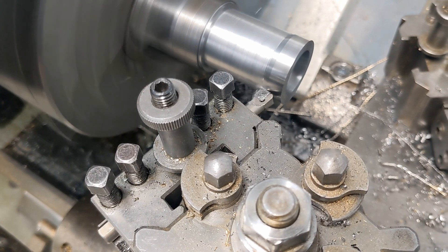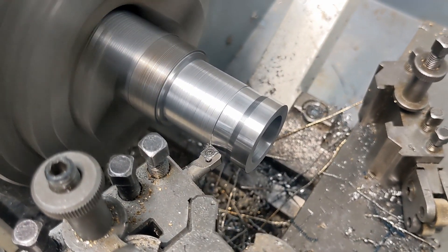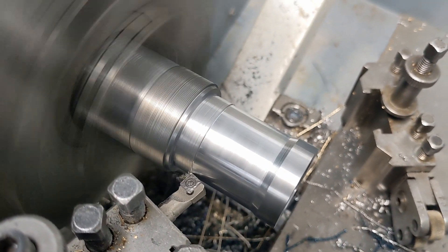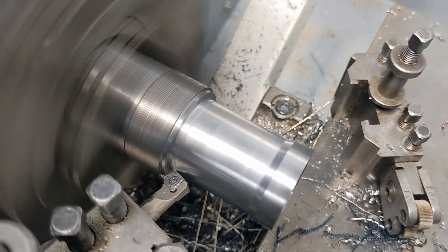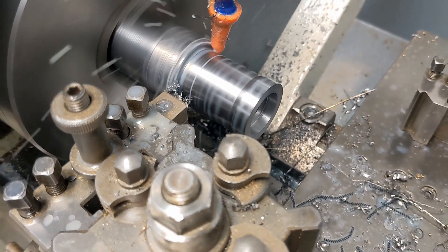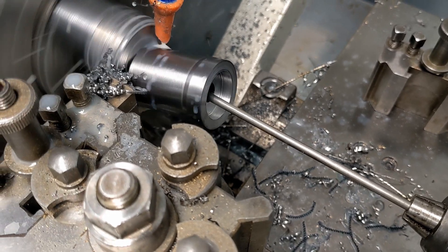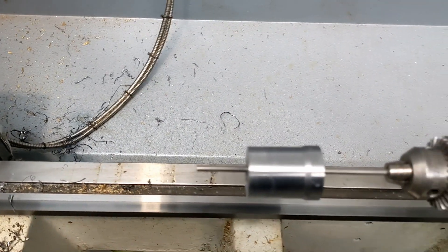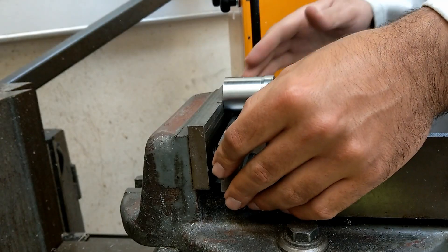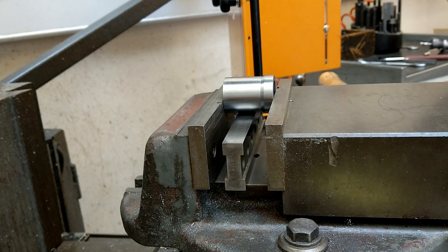After finishing the face, I marked about three-quarters of the length and turned it down to a smaller diameter. I didn't want my bracket to be very basic or just a round bar, so I removed some material from the lower base and put a chamfer between the bigger diameter and smaller diameter, then parted off the bracket. If you're enjoying this type of video, I'd appreciate it if you click the subscribe button and support the channel — it helps me create better content.